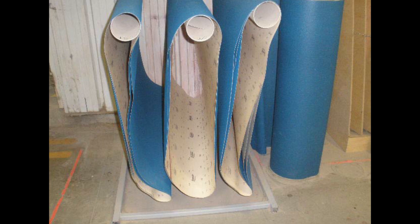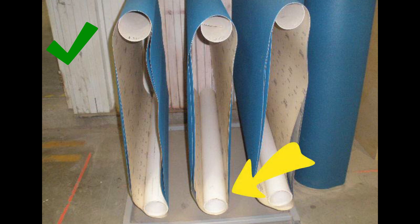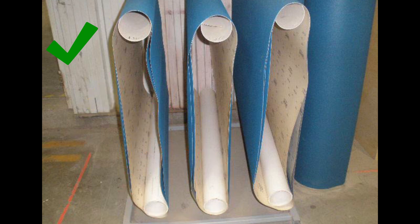The absolute most perfect way to store your wide belts is to hang them on a rack built out of three or four inch PVC — these are typically about the size of your idler rollers. For the very best method, get some PVC pipe, cut it three or four inches, the same width as your wide belts, and simply lay them inside the wide belts. It does not hurt the belts at all and has a lot of benefits. The grain on this belt is no longer touching the grain on that belt, which is a great improvement. In addition, as the day goes on, the belts are really going to straighten out and conform to that PVC pipe so that when you pull the belt to put it on the machine it slides in real easy.